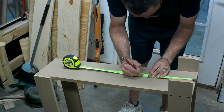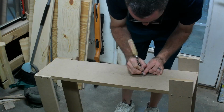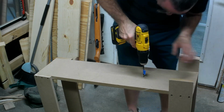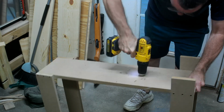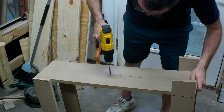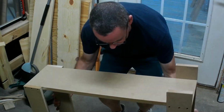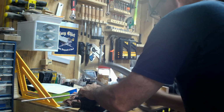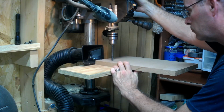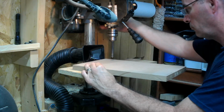Here I'm using my combination square to mark a center line down one side, then marking out the holes to be drilled through that side that match the holes I drilled in the pivot board. Then I can repeat the process on the other side. And some god-awful squeaking while cutting some steel rod for the pivot pegs. Bam! Drilling some holes here for the guide bearings, which then get bolted to the router mounting board and tightened down.